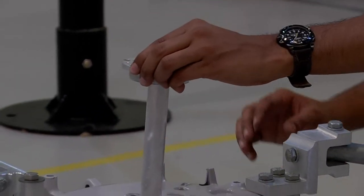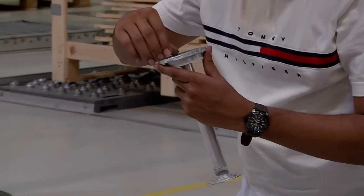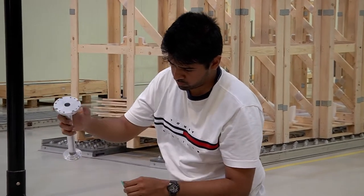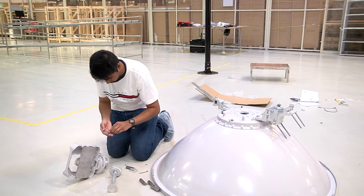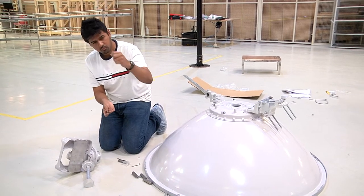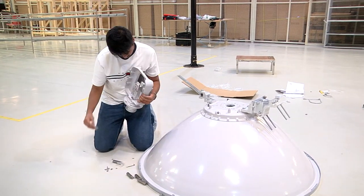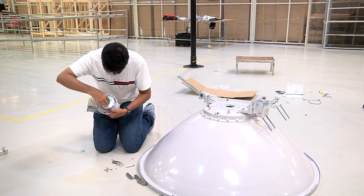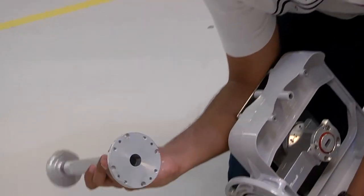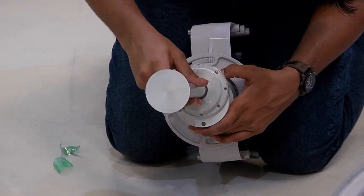The feed must be carefully removed from the antenna. Its protective label is first removed, as is being demonstrated, and then we proceed to attach it to the OMT radio interface. The OMT radio interface must be attached to the feeder such that its guiding pins go straight into the guiding holes in the feeder, as is being demonstrated after removal of the protective cover.